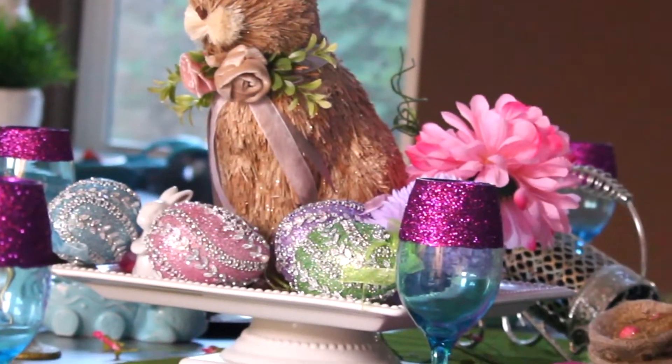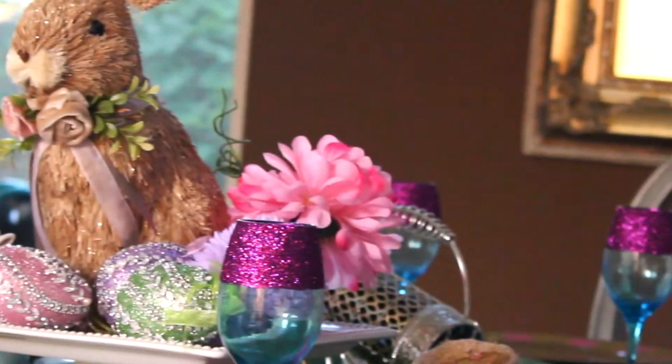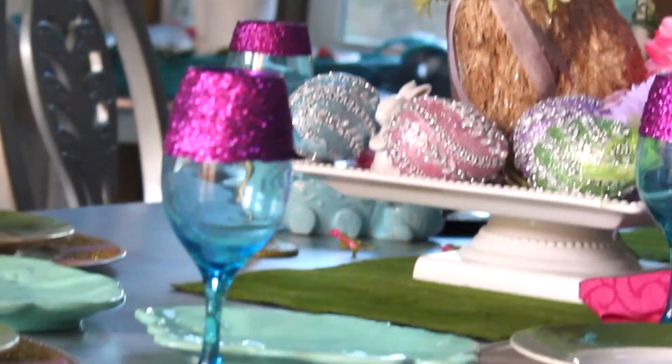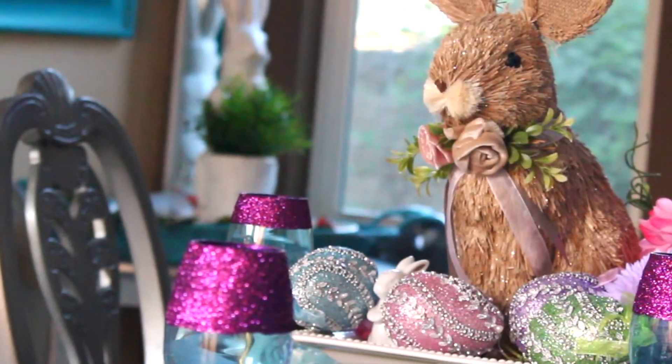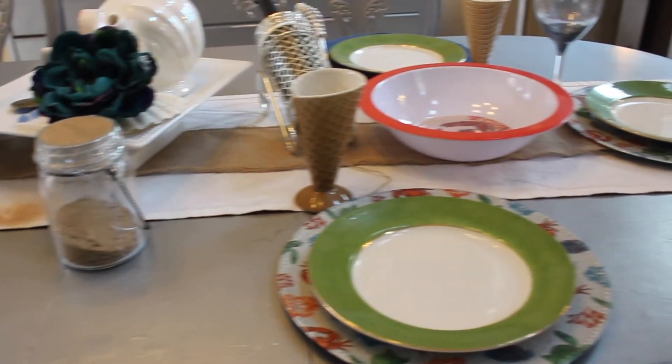Sand your piece, being that you're getting maybe a refurbished piece from a yard sale or thrift store like I did. Make sure that it is clean — we don't want to refurbish anything that is dirty. So I first took a soapy bucket of water, just some water and Dawn soap, and I scrubbed the piece down. After that, I followed up with sanding it, and then again I went over it with a damp towel to make sure that all of the sanding particles were gone.